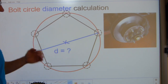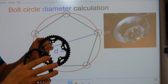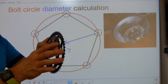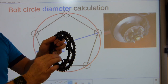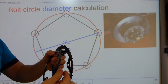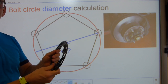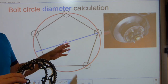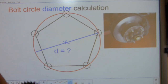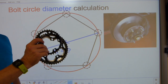If you're fabricating pipe flanges, bolts and bolt hole locations are typically laid out on a circle. Pipes are sometimes terminated in a flange, and two pipes can be bolted together by their flanges when the bolt holes match on two opposing flanges. Usually there's a compressible seal between the two pipes, and the compression is provided by the clamping force of the bolts torqued to specifications.